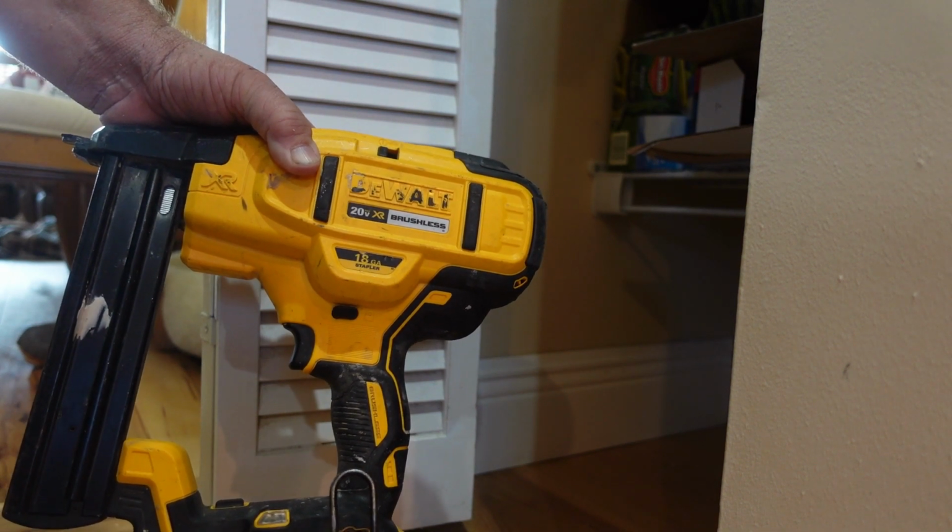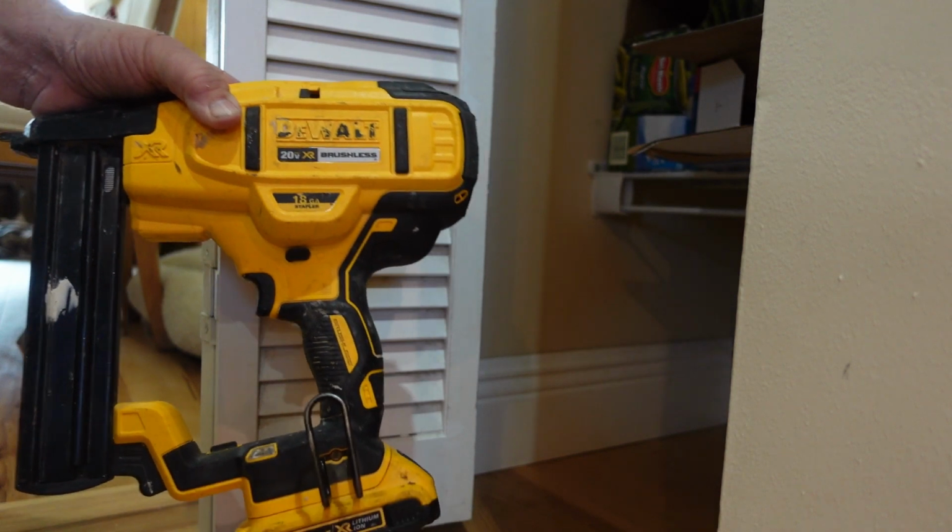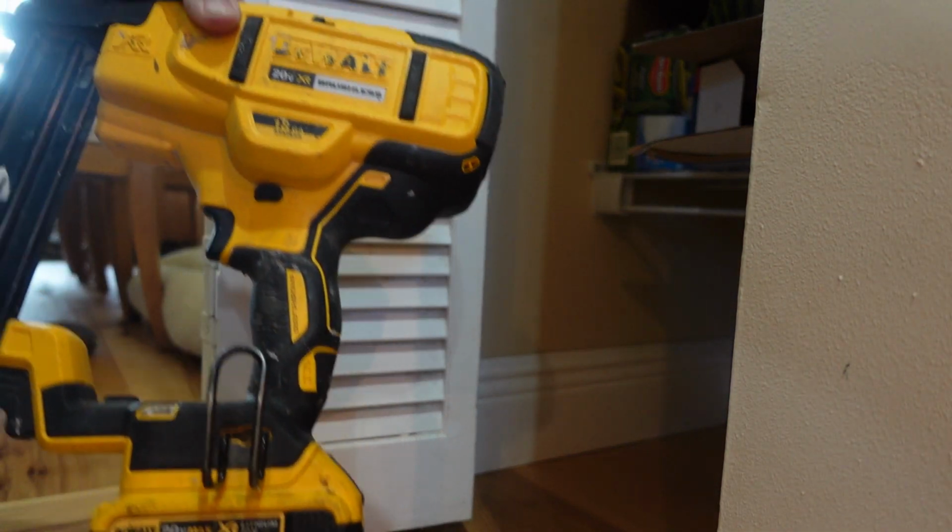And we don't need to go crazy. We joke around and call it hurricane proofing. We don't need to hurricane proof it, it's just base. They're going to be caulked, and believe it or not, the caulking holds it in as good as the nails once it dries, so you don't need a ton of nails or staples in your baseboards.